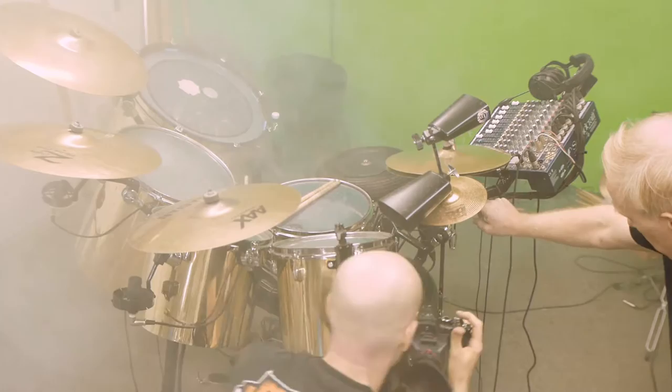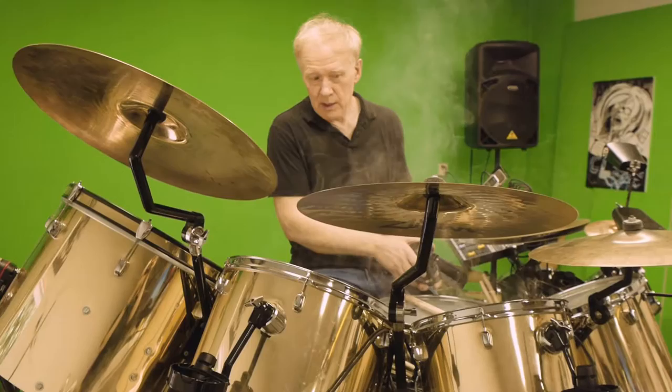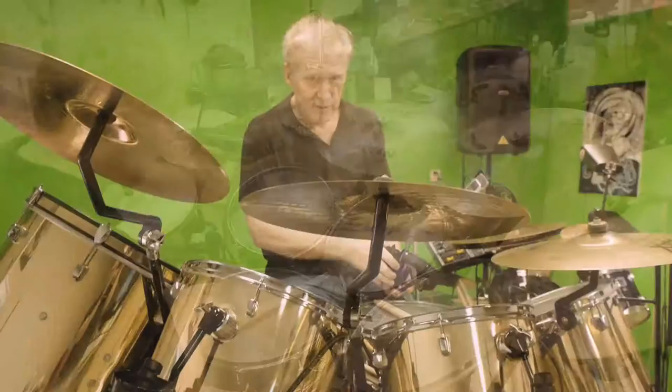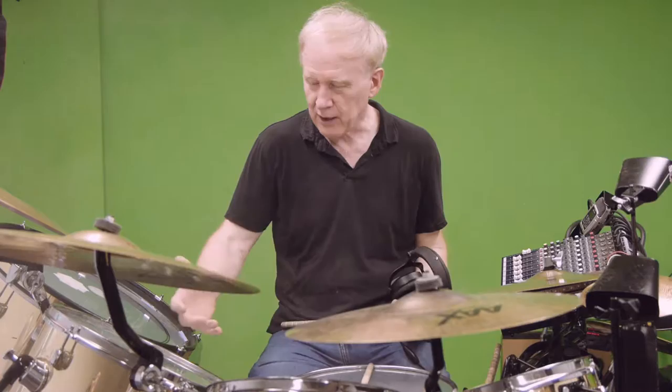To start the smoke and lights, they're set up so the smoke comes on and the lights dim up, and there's sound happening too for the lights — there's a little two-inch speaker. When I hit it, it gets a pulse that goes into a little microprocessor with an eight-channel analog-to-digital converter and an algorithm to pick out what is a trigger and what's not. It's mostly right.